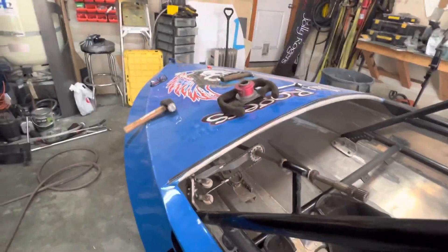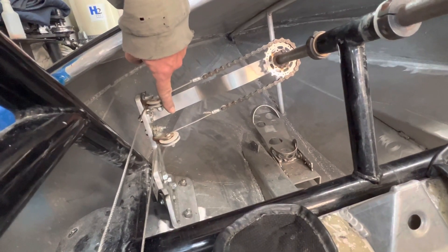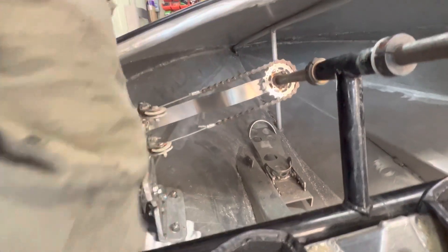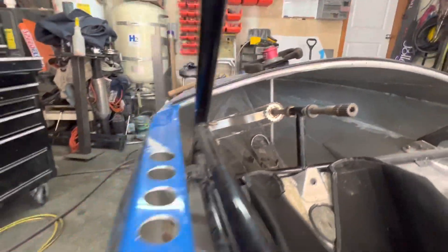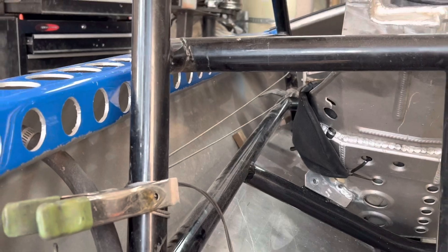One thing I really like is super smooth steering, but I also like the cables nice and tight — you don't want any slop in your chains or in the cables as they run full length. I do have to put some more pulleys back here. To keep everything aligned, you pretty much have to match the diameter of the sprocket. When I pull these tight, you can see those are nice and parallel. The only way I've found to fix things from not being parallel — see how my cables kind of taper down — in order to avoid any binding, if you need to change direction, it needs to be a long gradual transition. Otherwise you're asking for trouble. It's worth the time to do it right the first time and make sure those cables are absolutely perfect.